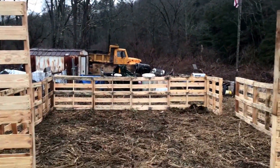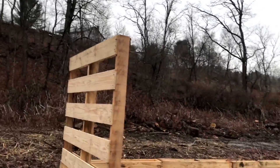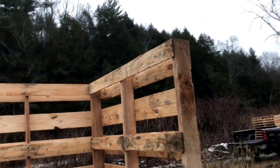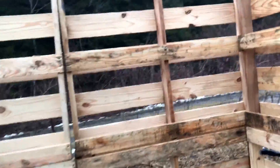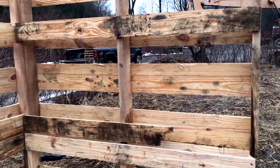The biggest predicament I have is the floor joists for the loft - they're gonna have to go across 16 feet. I'm so confused on how thick they have to be at 24-inch centers. If I price two-by-sixes, I'm gonna need 11 of them. That's about a hundred and seven dollars for 16-foot two-by-sixes. I haven't priced two-by-tens yet. If I could join 10-footers together I'd still need 22 - probably way too much - and that's not even addressing the trusses.